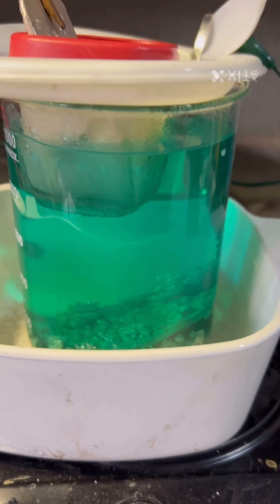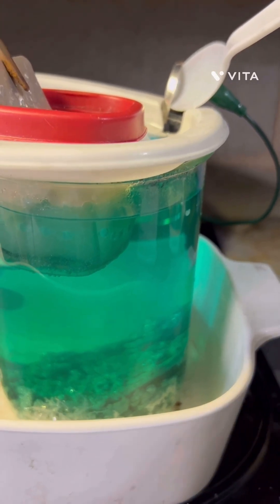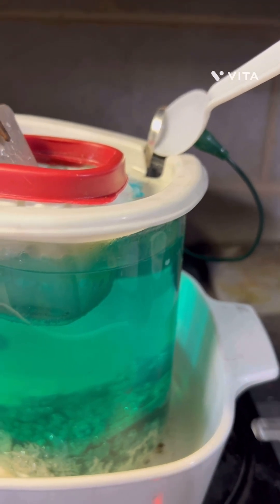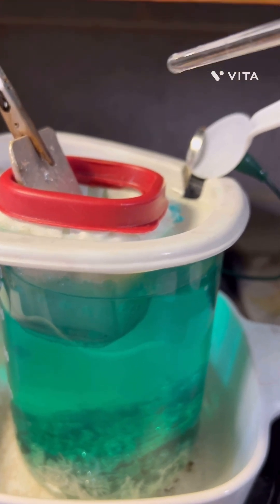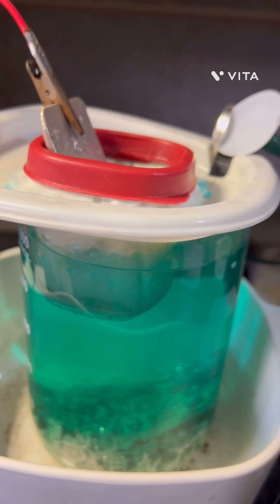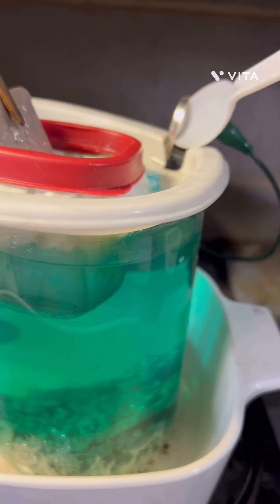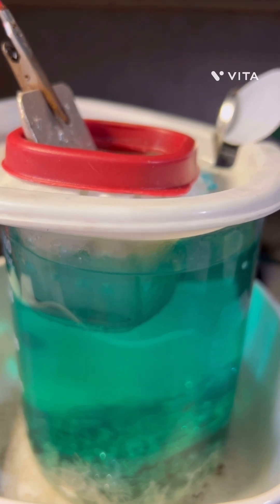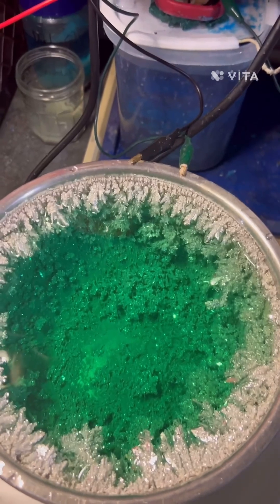Hello YouTubers, welcome to my channel. I am continuing to use the electrolyte from silver cell number 5. I had put a titanium cathode right here with a piece of stainless steel that has tape wrapped around it. I had to knock the crystals down — there's a 200 gram bar in there right now for the anode material, and we are developing really good crystals in the bottom. We'll try and wring out the rest of this electrolyte, maybe afterwards try and recover the copper out of the solution and recover that nitric acid. We're going to try and wring out as much silver as possible. Thanks for watching and don't forget to hit that like button and subscribe.